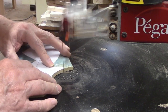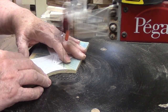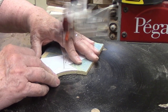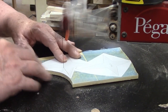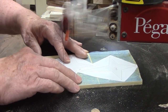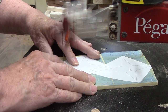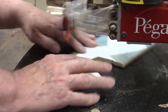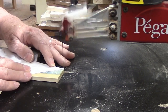I've used and tested a number of different brands and styles of blades over the years, and the Pegas modified geometry series are my first choice for every project. The size I choose depends on the thickness of the wood, the hardness, and the complexity of the pattern. Since the wood is only quarter-inch thick poplar — fairly soft — and the patterns are simple, picking the number three blade was an easy decision.